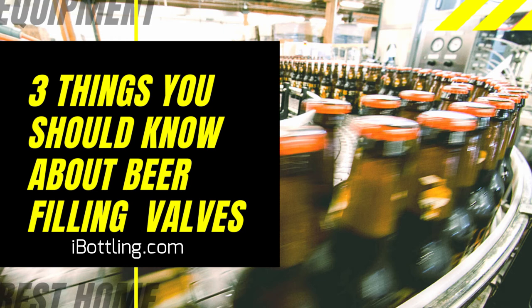Section 03: Maintenance of the filling machine. The beer filling machine has the most complicated operating procedures and production. It affects the quantity and quality of beer production. The beer filling machine is configured in a humid and acidic, harsh environment, and is operated in the high temperature climate in summer. Lubricating oil and grease should be filled in the relevant parts as per the regulations. Try to do the ventilation and drainage of the workshop. After work is completed, the equipment should be cleaned. The protective cover of the equipment should be installed to protect the transmission mechanism and ensure personal safety.